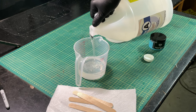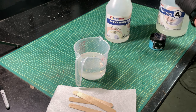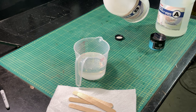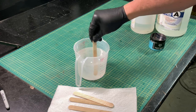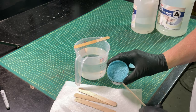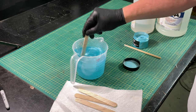Because of the slow cure, you generally don't get air bubbles in it unless you're really whipping it up, so it's pretty drama-free. We'll put the hardener in — measuring carefully by volume, not weight, for this particular resin — and do a nice slow stir for a few minutes. I'm wearing rubber gloves here; resin does bother some people. I'm going to use some black diamond pigment — this is mica pigment — which is nice because when you stir it in the mold you get a nice river effect. We just stir that in and you can see the shininess already.